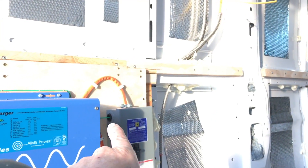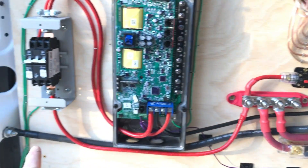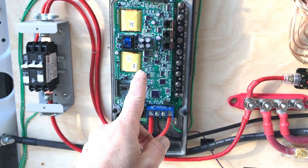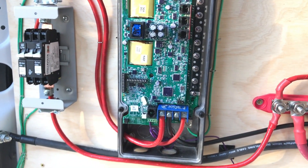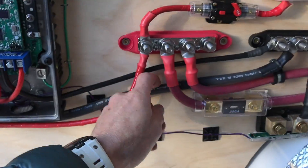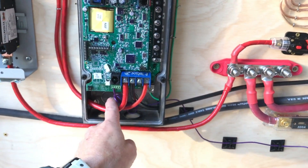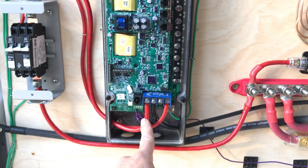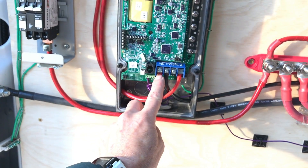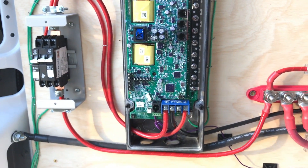The breaker panel also has a little ground. With this particular Midnight Solar Classic 150 charge controller, the biggest wire it will accept is 4 gauge THHN, which is a common household wire type. All the other heavy cables — the inverter leads and bus bar connections — are welding cable. The cable choice is mostly about fitting the largest wire the component will accept. Four gauge THHN will work, but four gauge welding wire is a little fatter and barely fits — you'd have to force it or trim some strands.